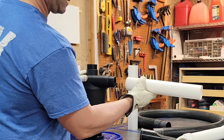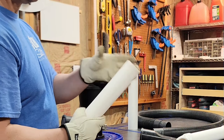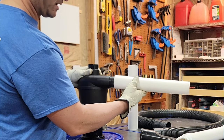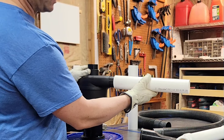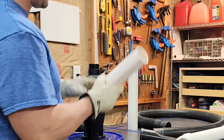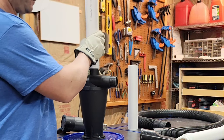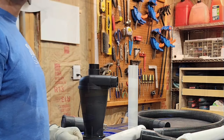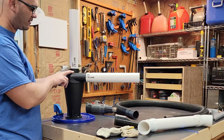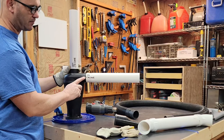There — you can see it's a good snug fit, and I can always put a clamp on there and tighten that down a little bit, or even try gluing it. You can see this side how loose that is — that's the side we haven't done anything with. We've got this tapered to a good fit right there, so we'll be able to do that to the rest and tie it all in. Same thing on the top so that we get a good connection. I've got the second piece of pipe coming out of the outlet side of the cyclone heated to fit the sleeve.